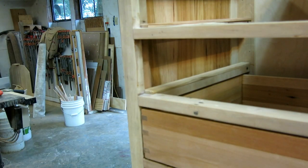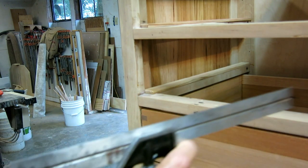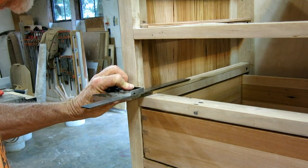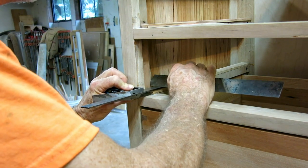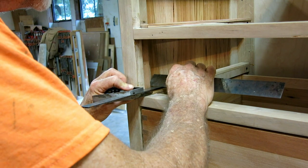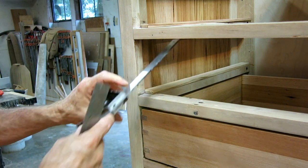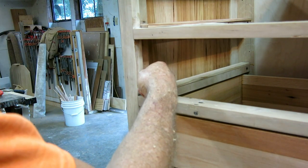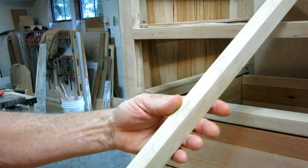This is how I'm doing it. I know the drawers are roughly 3/16ths short of the end on both sides. I can measure and I know the drawer guide — if I go back to the frame, it's 5/8ths and a 16th plus 3/16ths. Just maybe a little over 7/8ths will get it out 3/16ths. Then I cut a piece of wood from the back to right here and notch it for this little brace that I added, and this is what I end up with.